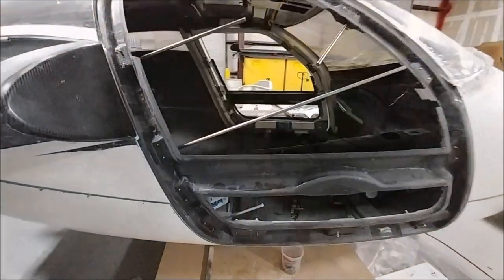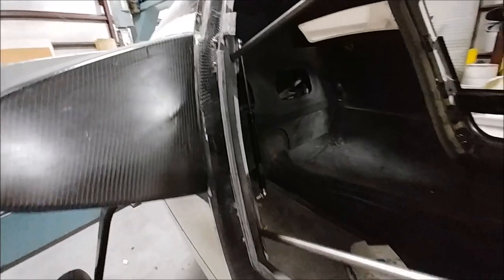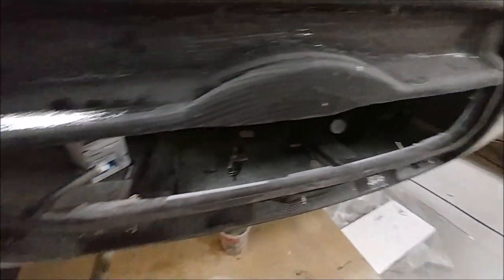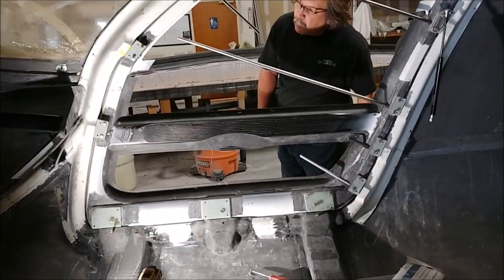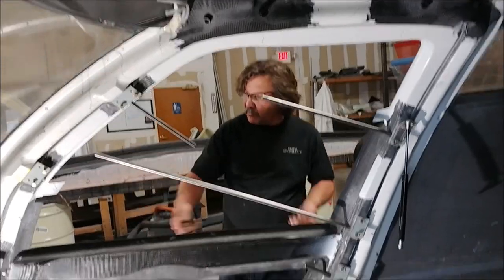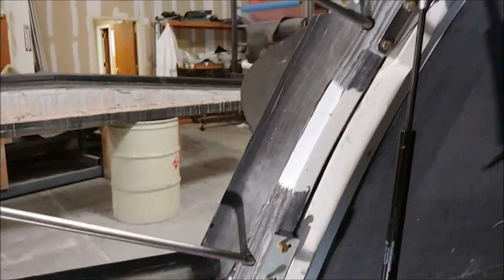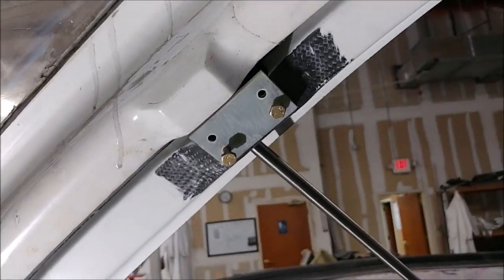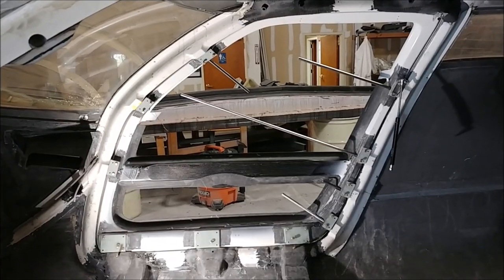Here we're bonding in those sleeves for the door pin locks. I've basically got a half-inch rod and bits of spare rod holding the sleeves in place — even though they're a fairly snug fit there's still a little bit of movement, so those hold them lined up with the actual locks while the Hysol sets up. I got all seven in there with various different lengths of rod keeping them in place. We've still got to do the one for the other side, and then that's another job done. Won't be long before we're finishing off the door work — still a few more things to do with the locks, but we're pushing through and getting it done.